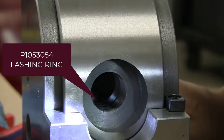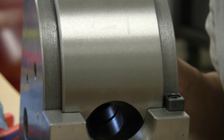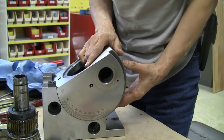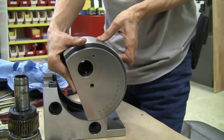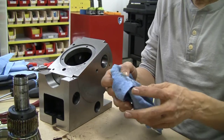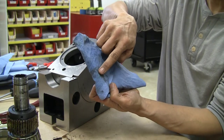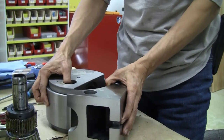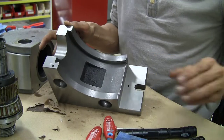This is a look at the rear bearing surface — you can see a slit that runs along it, and that is fed by oil from above. Still trying to get the head out, it is very difficult despite having removed all the parts that could be removed, including the front indexing lock. It just won't budge. Now this is the first time I have seen any shavings — tiny brass shavings from the nuts that hold the dovetail clamped together. Eventually I got it off by putting it on its side and a little bit of gentle rocking action, which allowed the whole thing to come apart. It was just so snug and tight that it wouldn't come out.